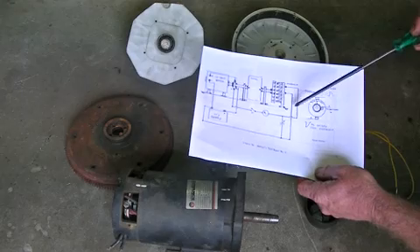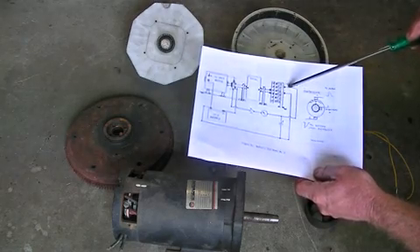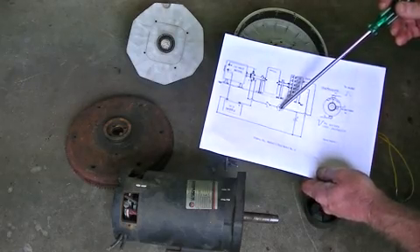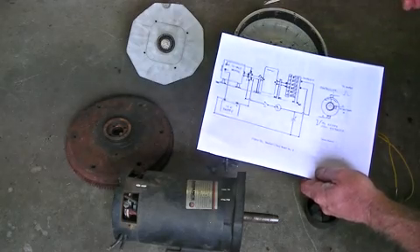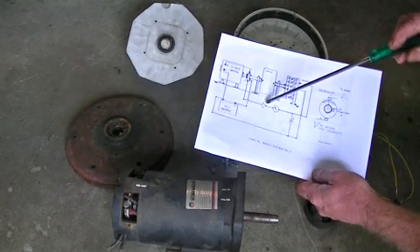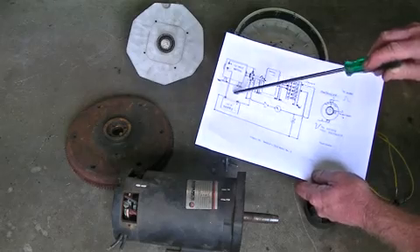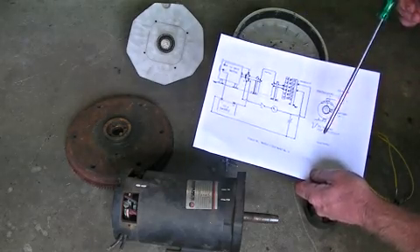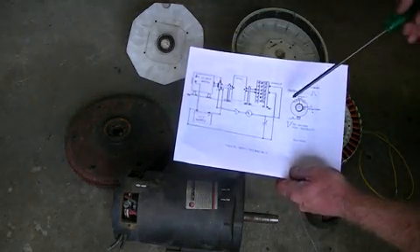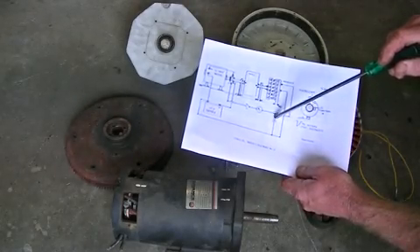Out of the energizer we have a cap across the output, but I do not see a bridge rectifier in this diagram — perhaps that is missing. There's also a circle with an arrow through it at about 10 o'clock — switch one was put in there to disconnect the energizer from the battery because apparently the battery voltage kept going up too high. He uses a commutator to time things so as the motor shuts off, the energy stored in the cap is dumped into the battery.